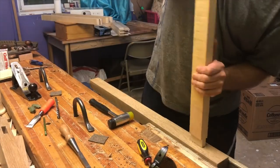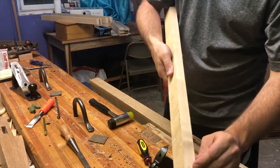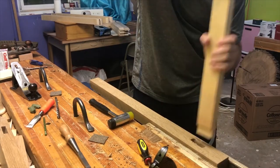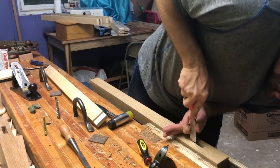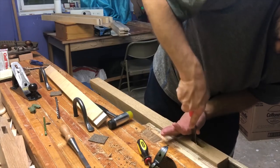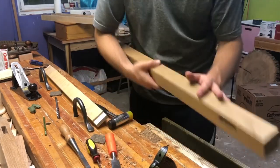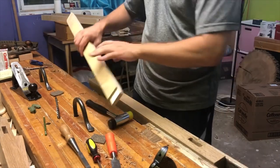So down. So this goes in here like this. So in case I lost you on that quick little bit there. I got my C here, so I know that's facing down, and it has to be away from here. So bloop, that means that the D goes right there. And I'm off by just a real little bit right there. It's right in there. I might step up to a 10. If I gotta do a little bit of work to trim them down, that's better than them being too loose. Because you don't want your tenons too loose. That's like throwing a hot dog down a hallway, and no one likes that.